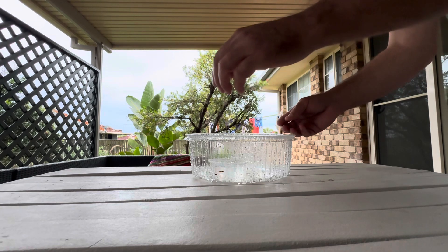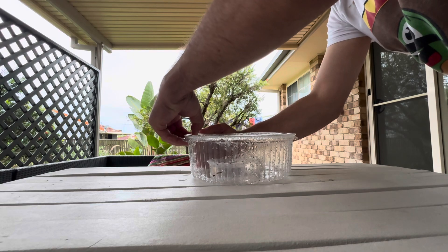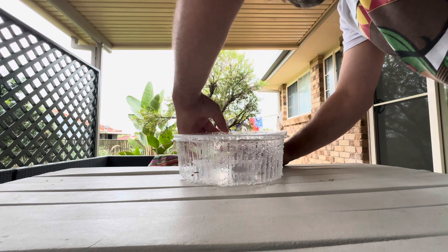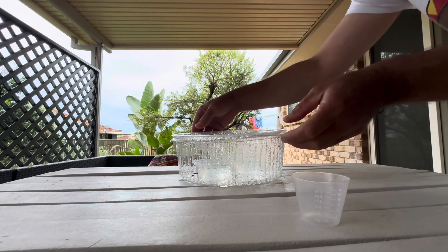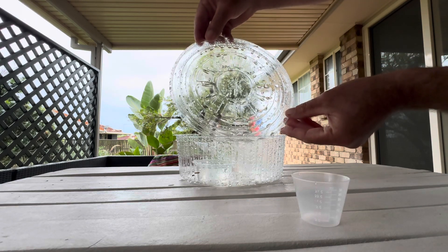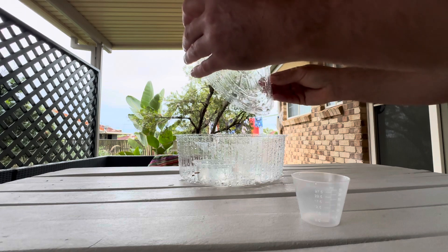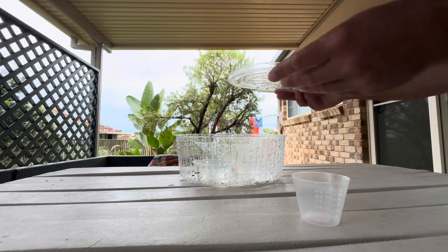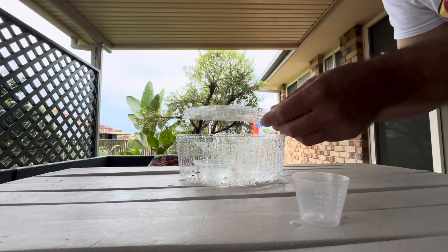Now, since making this video, I have been running other experiments on the side. A couple of them include adding black material to the seawater vessel itself to see if we can improve the evaporation results. In the previous one, the charcoal was fully submerged in the seawater vessel, and unfortunately it yielded reverse results — the results were worse than expected, as if the charcoal itself was prohibiting the evaporation of the seawater, so we got less distilled water from it. Another suggestion that came through was to not fully submerge the charcoal in the seawater — leave the seawater exposed to the air so it just soaks the seawater up into it, because charcoal is extremely porous. Then the evaporation occurred on the exposed charcoal, and what I found was it actually massively improved the yield.